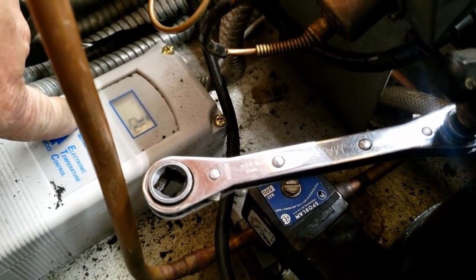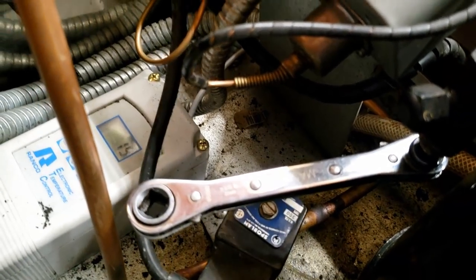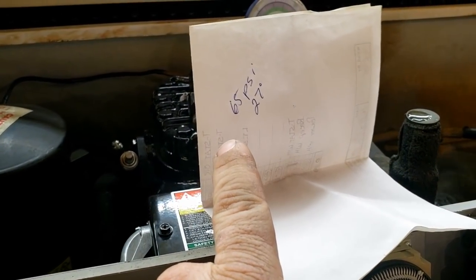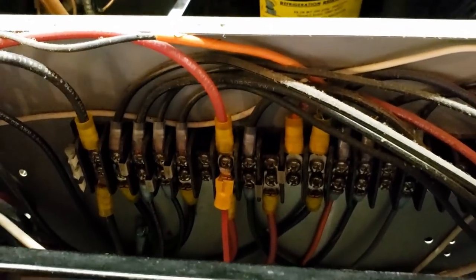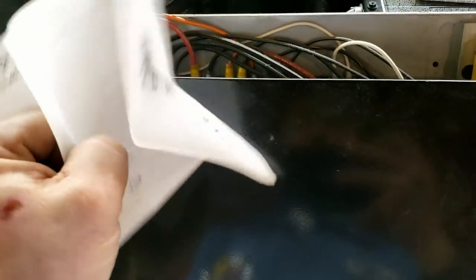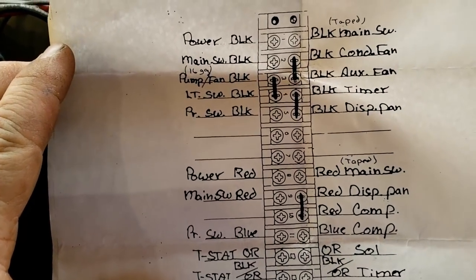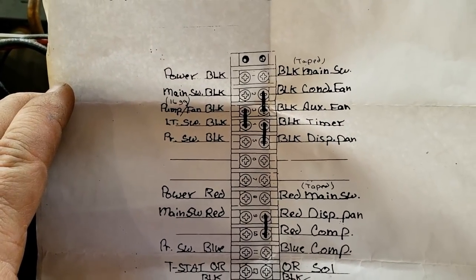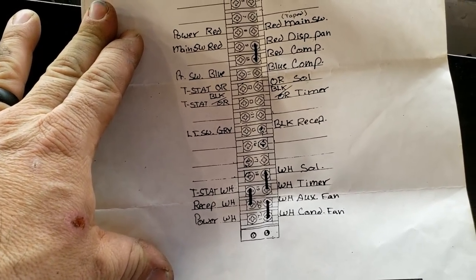The gauge looks like it might be reading a little better — getting up to 19 there, so that sensor must be in the ice or something. Checking the pressure switch: 65 for a cut-in comes out to about a 27-degree evaporator. Looking down into this tangled mess, nothing's really labeled. There's a little paper sheet that mentions an LT switch — maybe a limit switch — and a PR switch for pressure switch, but it doesn't show where they're hooked to or the internal wiring. Pretty much worthless unless you already know where things are going.